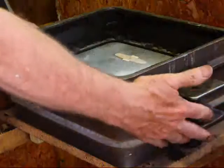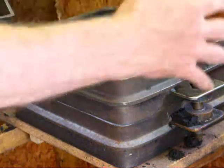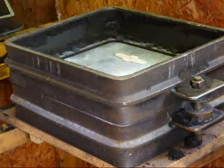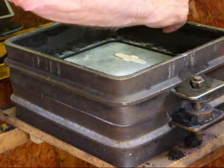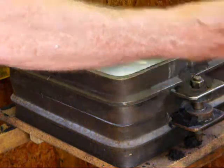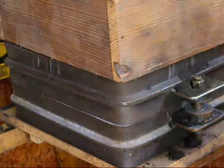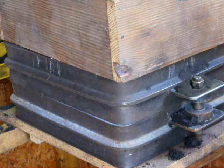I've put the two halves of the flask together. The paint marks on the side show that we match them up when we put them back together. At this point you've got to decide where you're going to run your sprue, because once the sand's in there you may forget. I'm going to take this chalk and mark coordinates — where these two lines intersect is where I'm going to put my sprue hole. The parting sand is in, and now we are ready to sift and ram the second side.